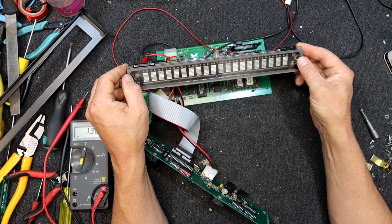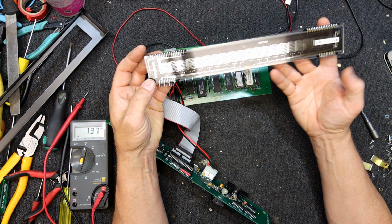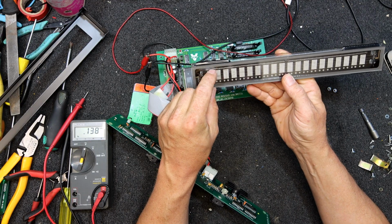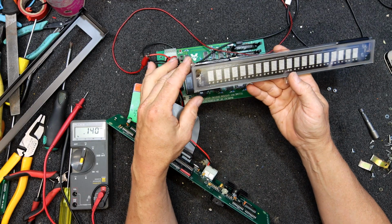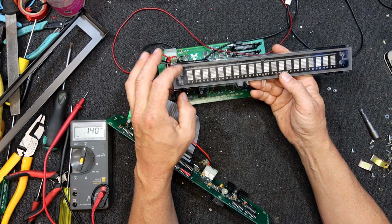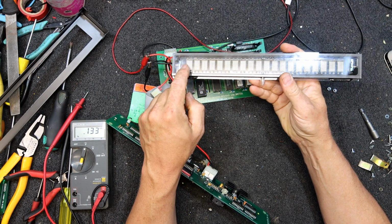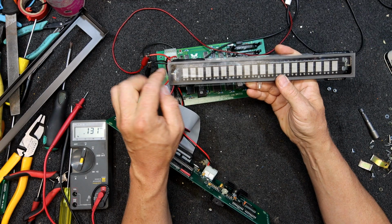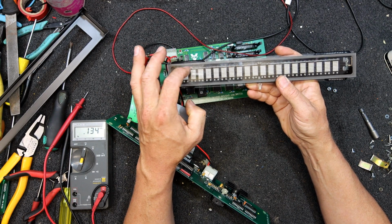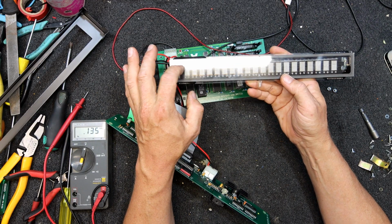The common cathode, anode, and these are just all the different, or the rows of dots. So the top left dot is connected to top left dot, and then you can multiplex this, which is where you very quickly pulse. So you put the entire row of them on, but you only hit each particular segment that you want the top piece on. So if we've got a number, I don't know, 7 might use that top corner, and 6 and 5 and so on. So each segment that uses a number like that gets that one lit up.